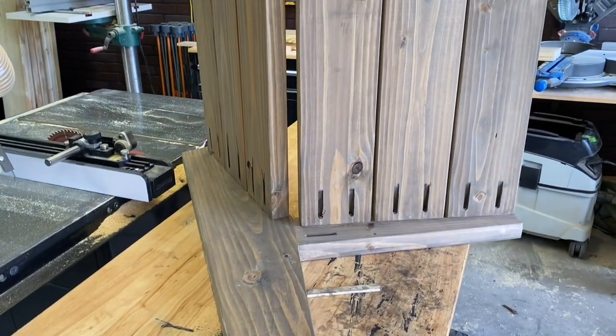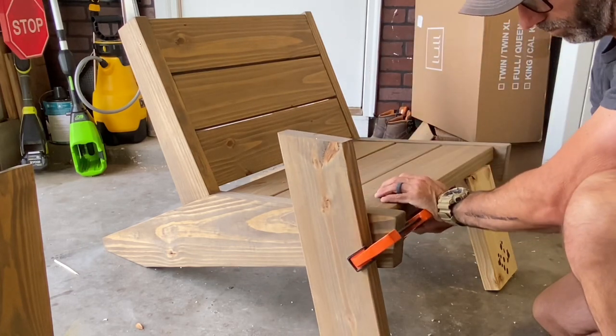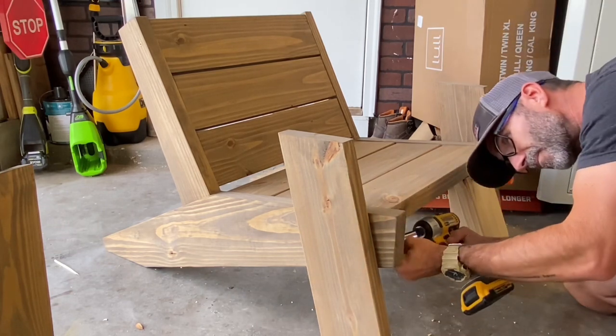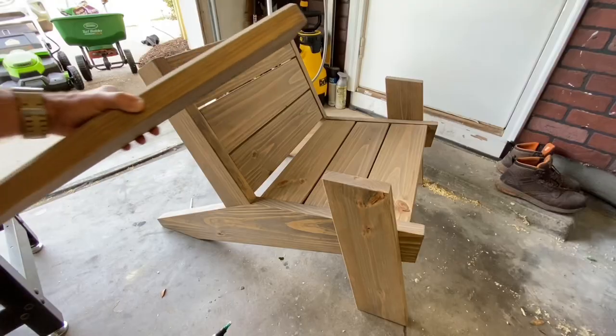After a little finessing and assembling the slats, I was ready. I moved the chair to the floor to put on the legs — clamped them down with some gear clamps and used two-inch screws from the inside. Repeat the process for the other leg, and once you're done you can remove the clamps and move on to the armrest.